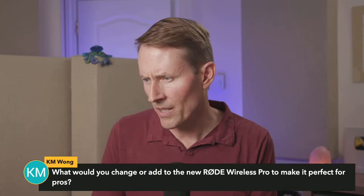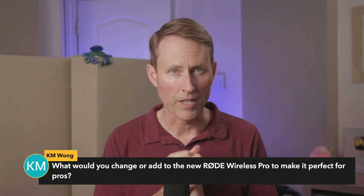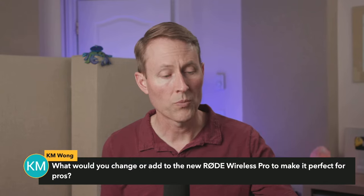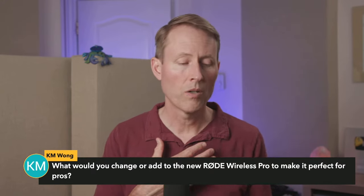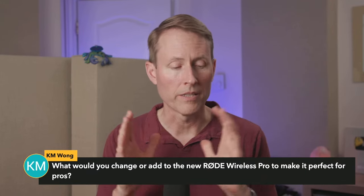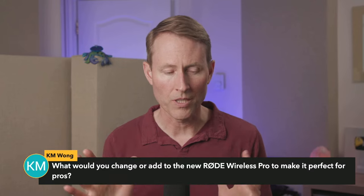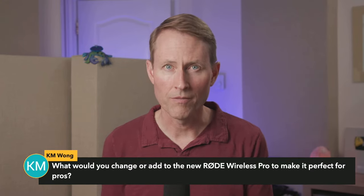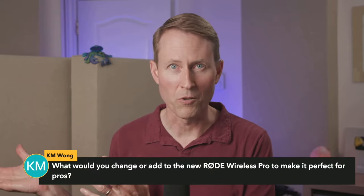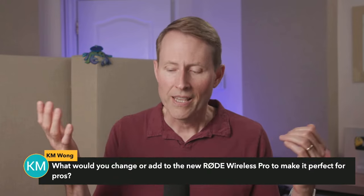Before I get there, I want to come back to this question from Cam Long. It's a really good one. I went on a fun rant, and there's one important thing I forgot to cover here. Part of why I don't consider the wireless pro what I typically think of as pro is because it is a 2.4 gigahertz system. I think I touched on it, but I want to call it out very directly. 2.4 gigahertz is super convenient, really nice to work with because it's so simple and easy. However, when it doesn't work, you have zero options to resolve that aside from picking up and finding a new place to record where there's not so much 2.4 gigahertz activity, and your wireless microphones will work again. That's pretty rare, to be honest.